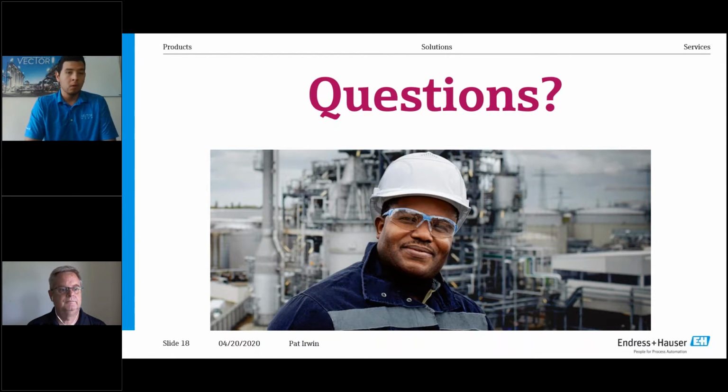Okay, great. Will the Endress+Hauser transmitters interface with the AMS and other asset management tools and configurators? The answer is yes. I've had personal experience with the Honeywell system and also with the AMS. We have many clients that choose to use the AMS as their platform, depending even on other manufacturers of distributed control systems. And yes, you have full configurability. We are members of the HART Foundation. So as I had mentioned, we're HART 7, and that keeps us current. But globally, we make sure with Profibus, with Foundation Fieldbus, and with HART, we have a specific group within Endress+Hauser that is their job, is to stay current and make sure that we have all of the updates available to all manufacturers.